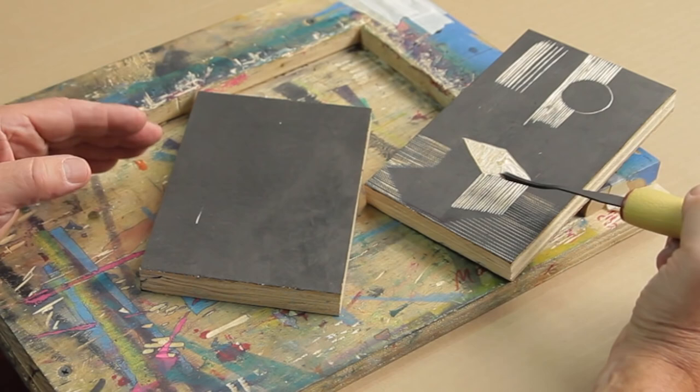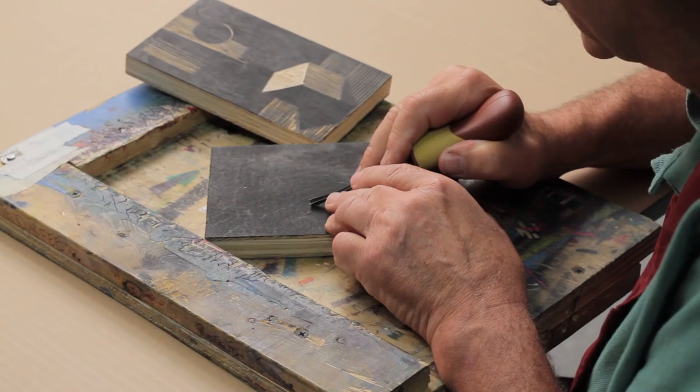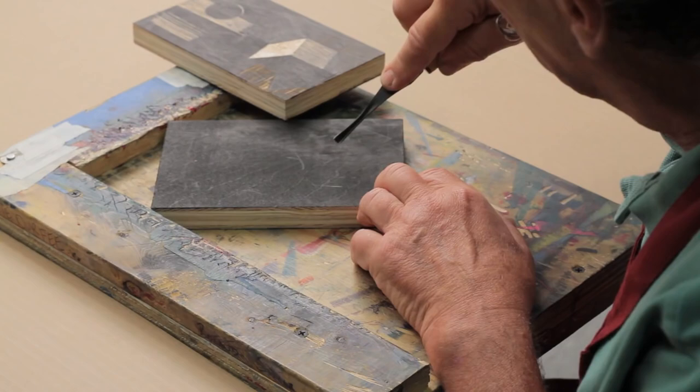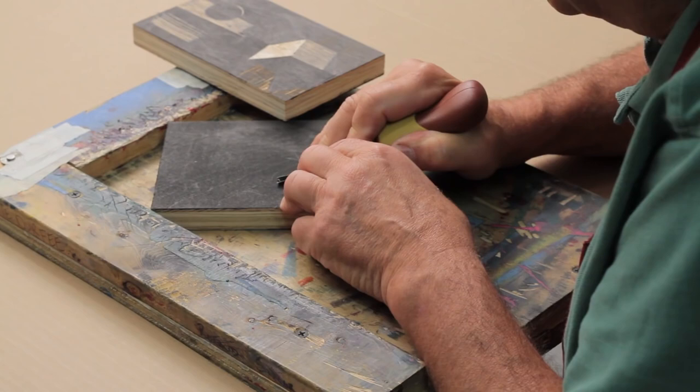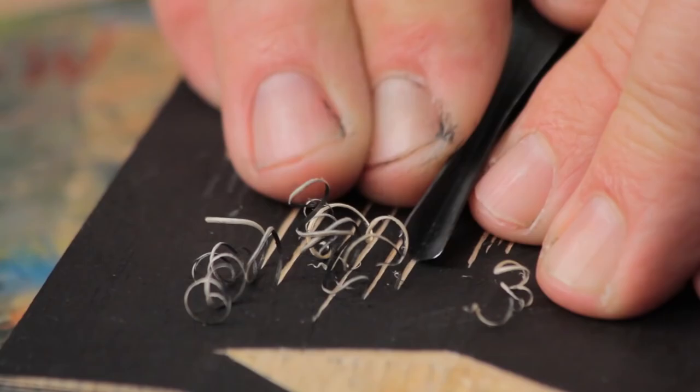As far as handling the tool, I hold it like a pencil and use my other hand to help guide it. With both hands on the tool, you're not going to cut yourself. Don't dive-bomb it — a lot of beginners try to cut that way, but you have no control and it's dangerous. Find a way to have more control. I push it and as soon as I want to stop, I stop. Just inch it forward. You can tell it's sharp by that little spiral of wood that comes out in front.